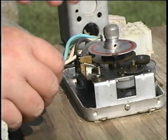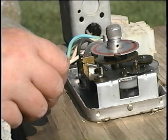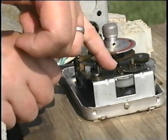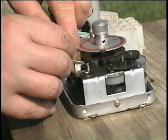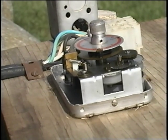When you come out to check and if the motor is not running, you can trip the timer to get it started. First of all, make sure the timer is working — the little gear should be running. What you do is push down here on this little bar, pull out on this, and that should trip the motor. There we go.